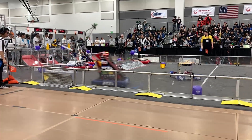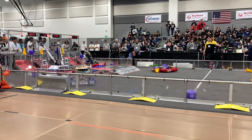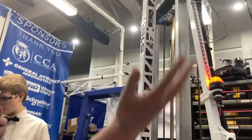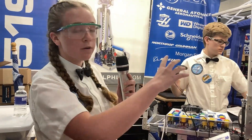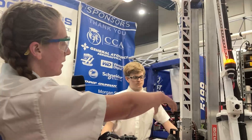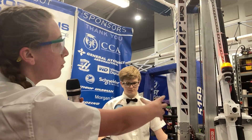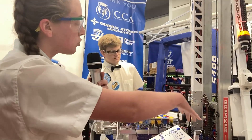Our arm is one of the main pieces on the robot. It goes 180 degrees, so we don't have to flip the robot back and forth — we can intake on one side and score on the other. We pocketed it out in a way that maintained structural integrity and lightened the weight of the robot so we had more weight at the bottom to control our center of gravity.